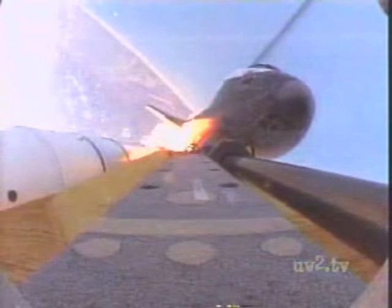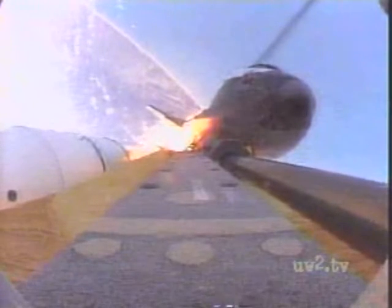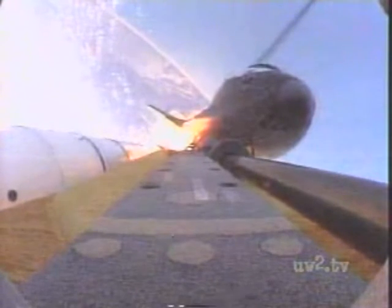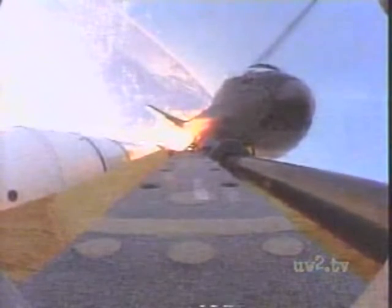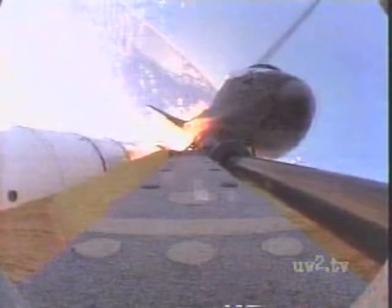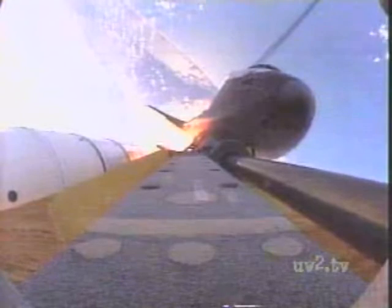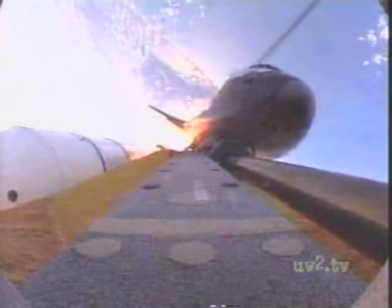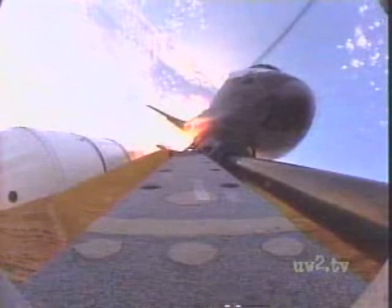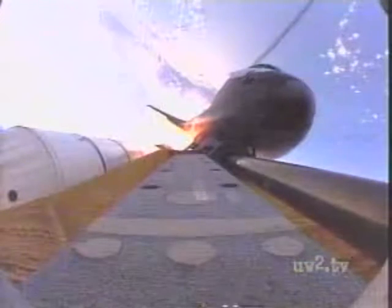35 minutes into the flight of Atlantis here in Mission Control, the ascent team of flight controllers led by Flight Director John Shannon continue to watch over the crew as they continue in their post-insertion timeline, having closed and latched the external tank umbilical doors, having previously shut down the auxiliary power units, which functioned perfectly en route to orbit, as did Atlantis's main engines, and as are its power-producing fuel cells, as we prepare for the firing of the orbital maneuvering system engines once again, just over 3 minutes from now. This will be a 1-minute, 3-second firing of both OMS engines to increase Atlantis's altitude and further propel it toward the International Space Station.